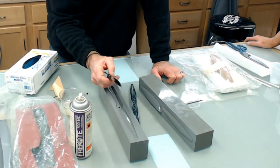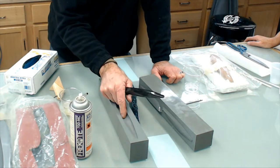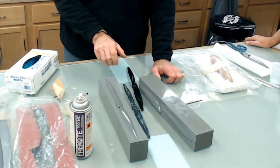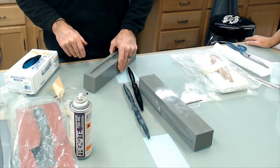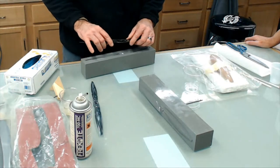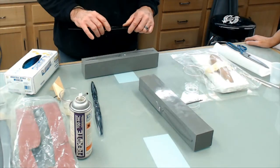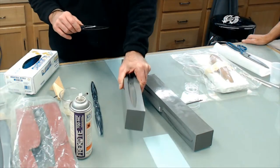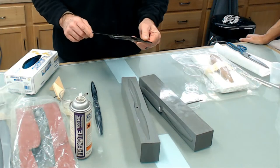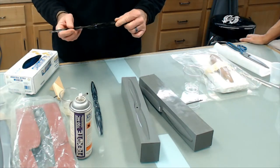And when I made it, this mold was in the oven, I think it was around 150, 200. So I pulled this mold out of the oven hot, and I started to lay this prop up. It was a high temp resin. And by being a really high temp, it allowed the resin to flow really well, and came out like this. This is the way it came out of the mold. This doesn't have clear coat on it. It hadn't been sanded.